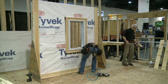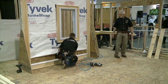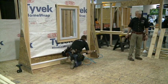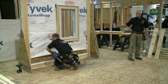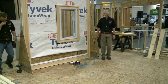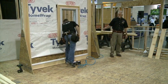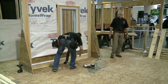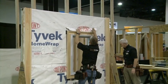He's going to recut along the bottom and lift up the house wrap so we're putting the drip cap down on the water table. He's just going to tack it on — you don't have to go crazy. We're going to be pulling it apart, but just flash it. We want to make sure that any water that comes down along the wood comes out, so we want to put flashing all the way across the top, like we did the window flange. Let's start at the bottom and put that down.